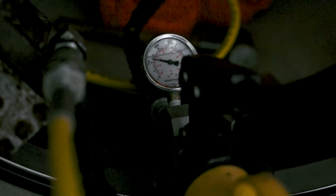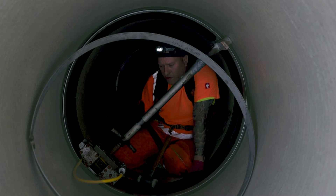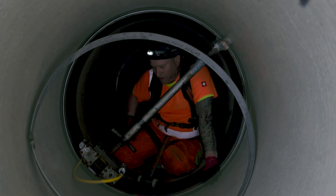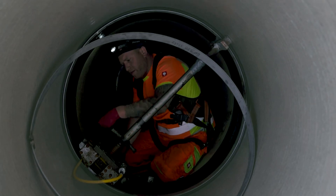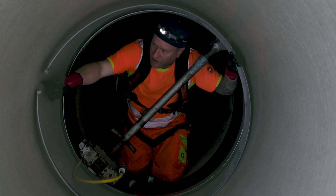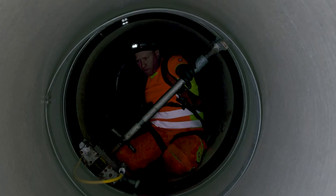As you knock, you'll see the pressure needle drop. When you reach a point where that needle will not drop and you're comfortable the pressure is maintained, you use the selection of wedges sent in your package. Wedges go up in increments of two millimetres — starting at about 40mm, then 42, 44, 46, 48, 50, up to about 90mm. Drive your wedge into the gap on the ring, making sure to get it right into the H-block. Choose the correct wedge and physically drive it into that gap.